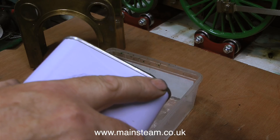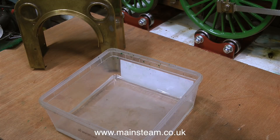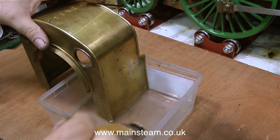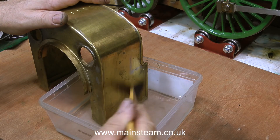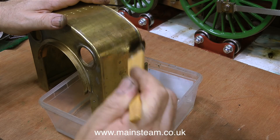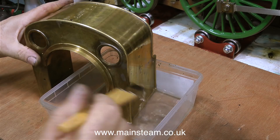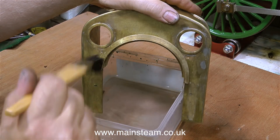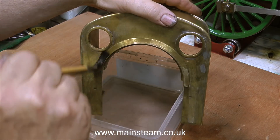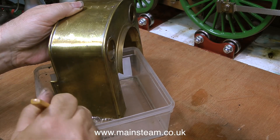With the handrails removed, it's time to degrease this part. I'm not going to use the parts washer - I'm just going to use some panel wipe in a fairly substantial plastic tub. The cab looks fairly clean but I'm sure it's not going to be. Coal-fired steam locomotives are great things and I've had a love affair with them for many years, but the problem is the coal, grit and ash gets into every nook and cranny. What makes it worse is the ash is usually mixed with steam oil, because steam oil is pumped into the cylinders and exits the engine with the exhaust steam from the chimney. So don't forget - degrease first before you do anything to the part you're going to paint.